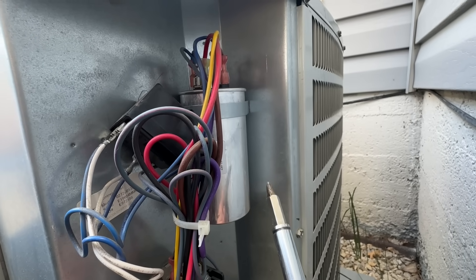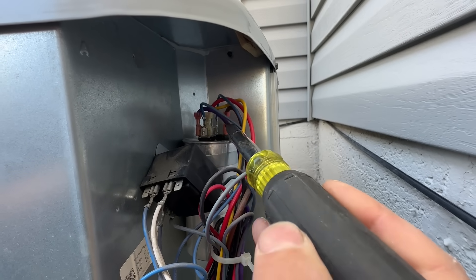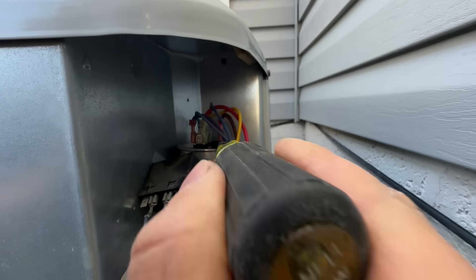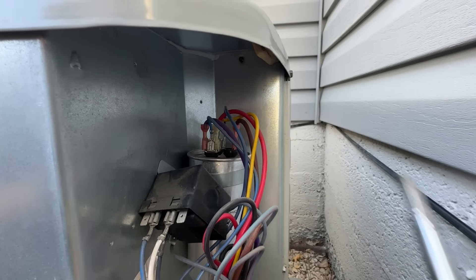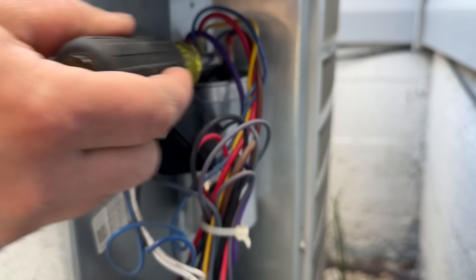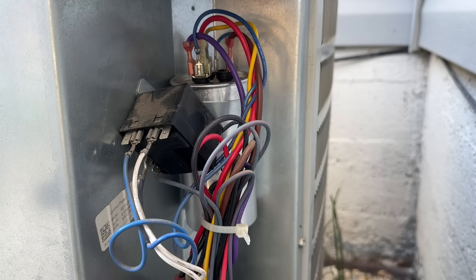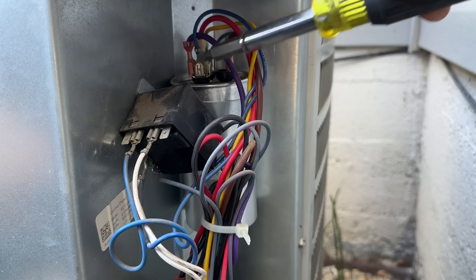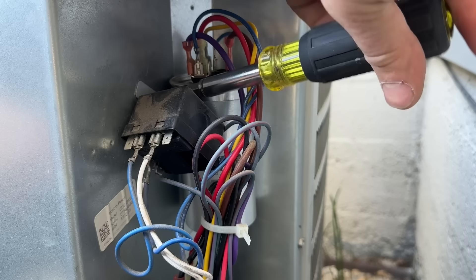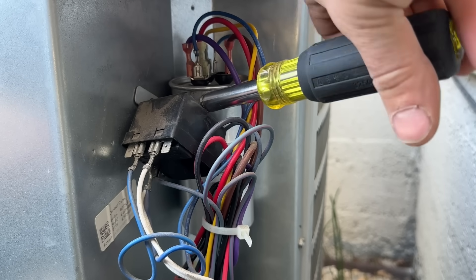Because this acts as a battery, the unit will sometimes hold a charge, so it's very important that when you take this capacitor out, you discharge the leads by jumping a screwdriver between all of them — that will effectively discharge the unit. I would go ahead and arc these together while it's still attached to the unit for a little additional safety. Just FYI, I have never gotten popped by one of these, and for a long time I did not discharge capacitors, but you want to be as safe as possible. I've heard of people getting popped even after the power is off.